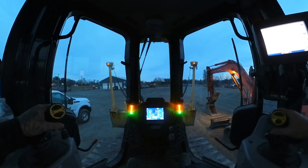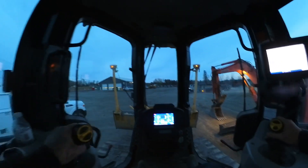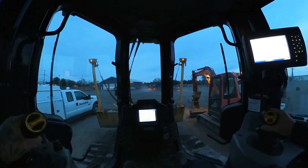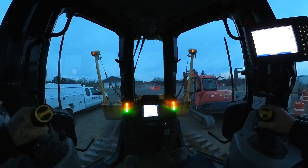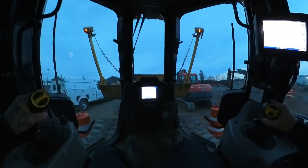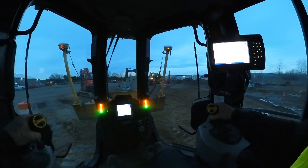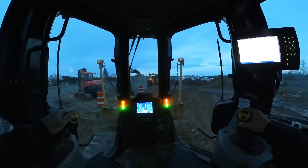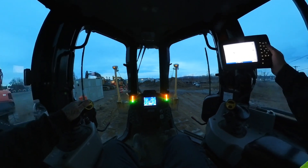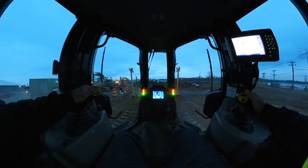Today I'm going to show you how to do markout with the dozer, because the rover doesn't have charged batteries. As an alternative, we have this dual-phase GPS. I'm going to show you how to go over, identify the structure, and mark it out. We've got a guy down there right now with grade stakes.